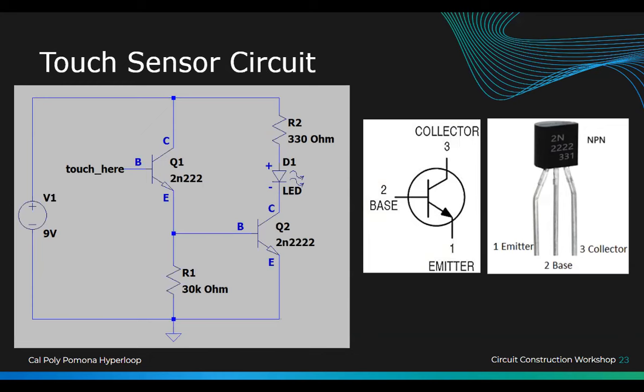Huh? Why does that work? So your body is a resistor. And a capacitor too. So if you touch it, you're providing current into the base. Interesting. So to make it easier, I just told people that you put power into it, but the BJT is a current-controlled transistor, so it needs current to turn it on. But a MOSFET uses volts really well though.